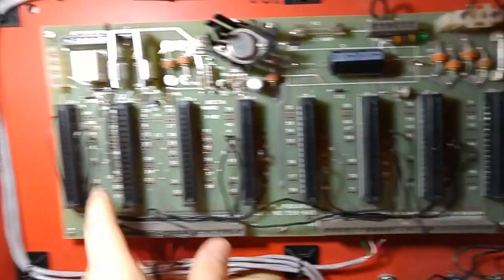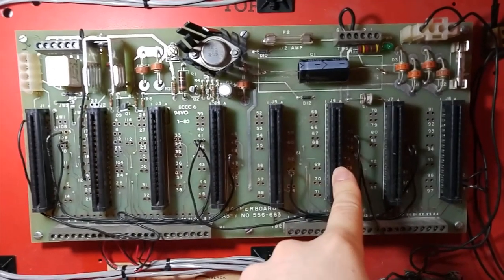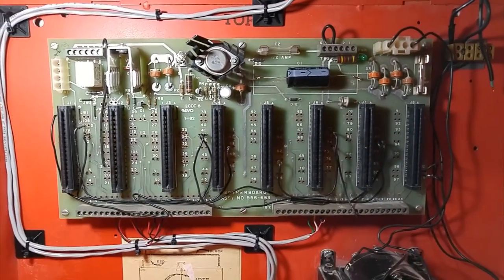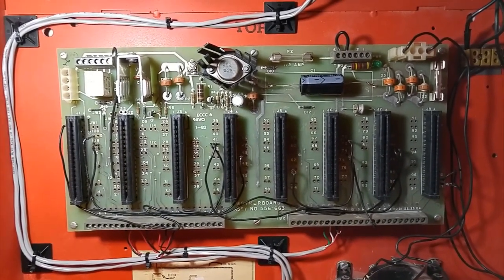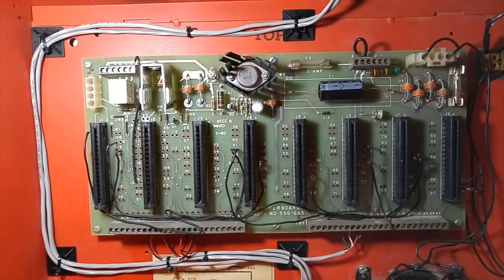However, on my panel, I have that running through the March time card and then to the NAC card, so that the March time card can control one of the NACs. The other NAC is controlled by the 24 volt out in alarm, so that it's also controlled by the NAC card, but it's set up so that NAC stays on when the panel is silenced, while the other one cuts off when the panel is silenced.